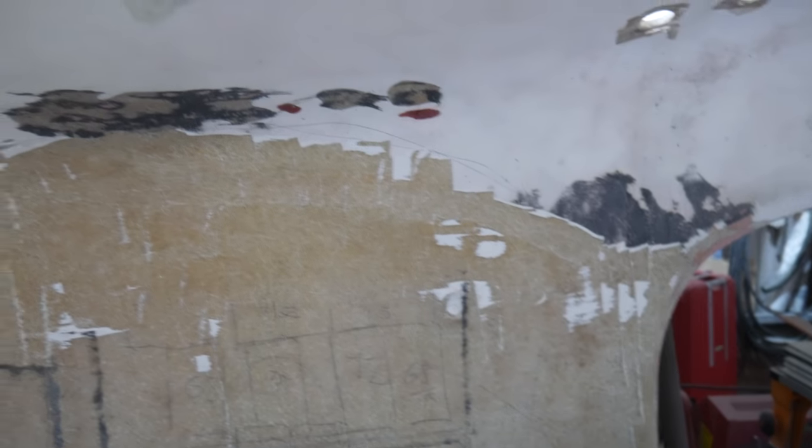So that's what this side of the hull looks like now. I've just used the planer to get a little bit higher, and the good thing is that right there is under the engine beds - the laminate looks really good, it's clean and there's nothing coming through, so it looks pretty solid. Reading from the outside the moisture levels are good, so I don't think there's anything critically wrong with the laminate there.